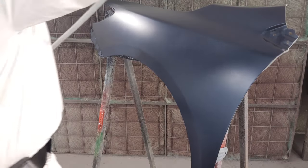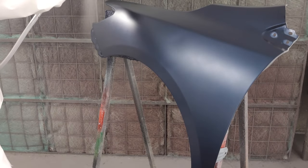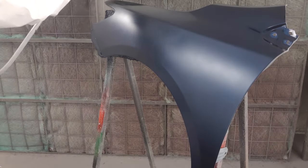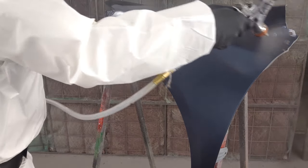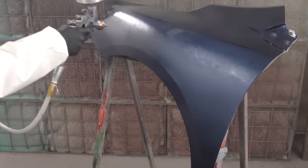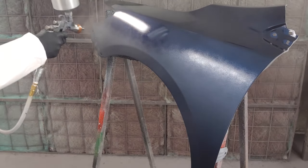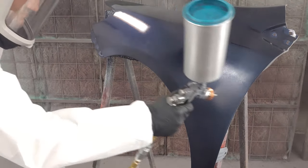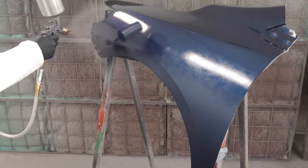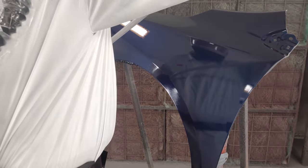At this point you are ready to do a test spray on paper or on your booth wall. Your spray pattern should be a tight and uniform ellipse. If not, you may need to clean some of the small orifices in your spray tip or air cap. Once you have a good spray pattern, it's a good idea to spray a test panel to make sure the product flows well and is doing what you want with your settings. Apply two to four wet coats with 50 to 75% overlap allowing 15 minute flash times between coats. A six to eight inch fan pattern at approximately a six inch gun distance is a good general rule.